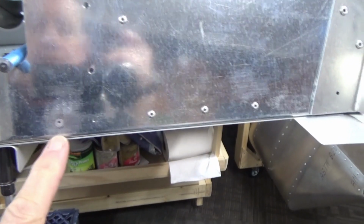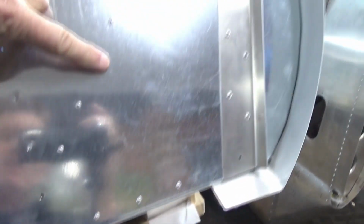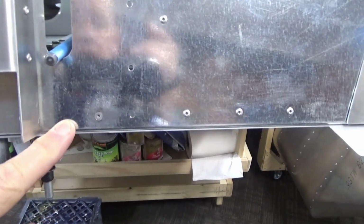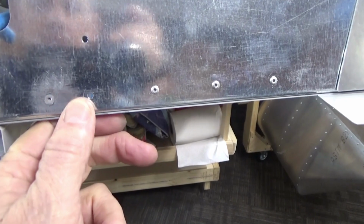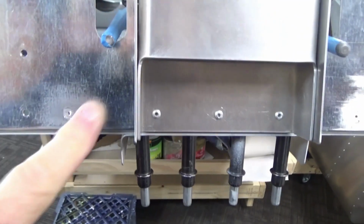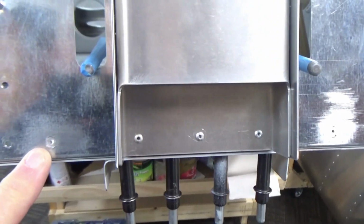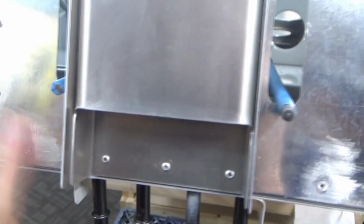This rivet gets in the way. I took it out, but on the back there's an L angle that runs all the way up, a diagonal, and because it attaches to the cross member here, another L angle on the bottom. I countersunk it, put the rivet back in and cleaned it up, because I think that rivet is pretty structural. It's in there, sanded it, and now that's nice and flush.